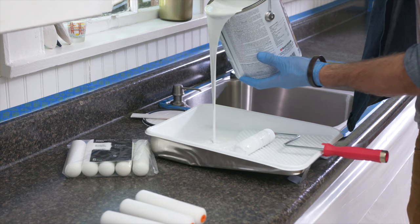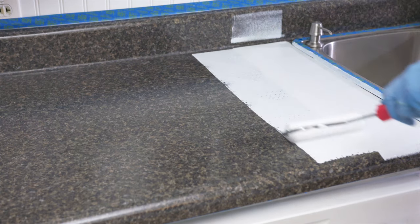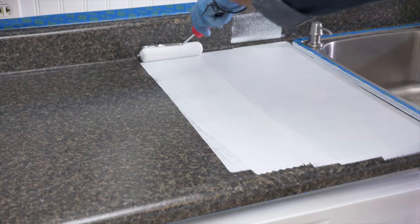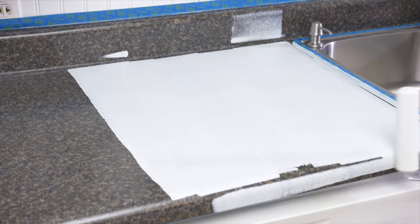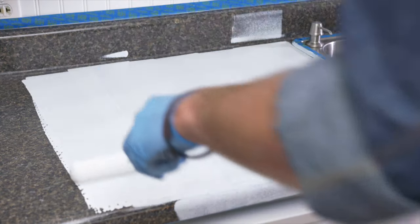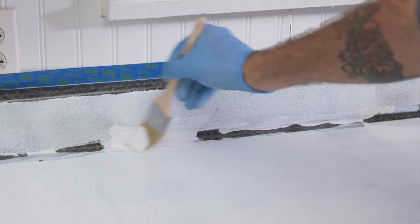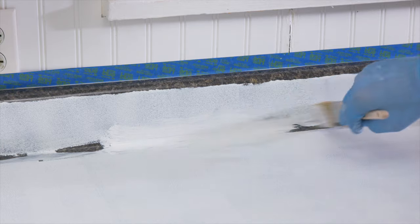While priming and painting countertops, it is important to keep a wet edge to your paint application. Do not stop this project in the middle and allow the area just painted or primed to dry. Overlap your newest roller strokes an inch or so over the previous strokes. Apply an even coat of primer covering the entire surface with full roller strokes from front to back. As you approach the area around the sink or the small backsplash surface, be ready to use a quality trim brush to cover the surface as your wet paint edge encounters it. Move from one edge of the counter to the other, covering the entire area with primer as you go.